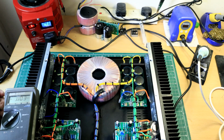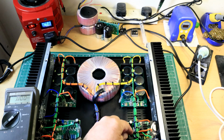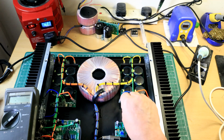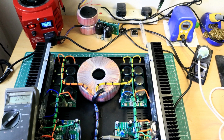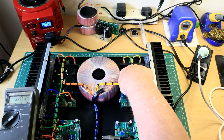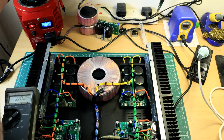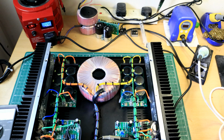So we now have to perform exactly the same procedure on this power supply. So I'll get onto this zero. There's 0 volts there on the board, 50 volts, minus 50 volts. So we have proved the transformer, the switch, the switch is fused, 4T fuse. We've proved that this power supply is working fine. So we're going to dump all this now, turn the power off. And I'm going to go and make a cup of tea, and I'll be back in a minute.